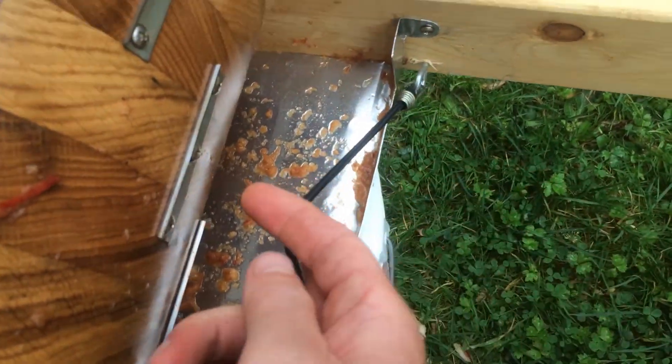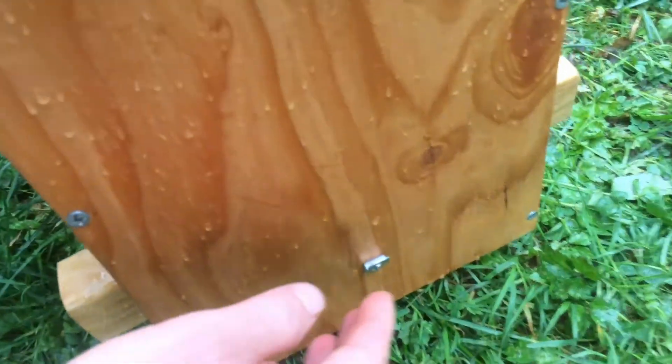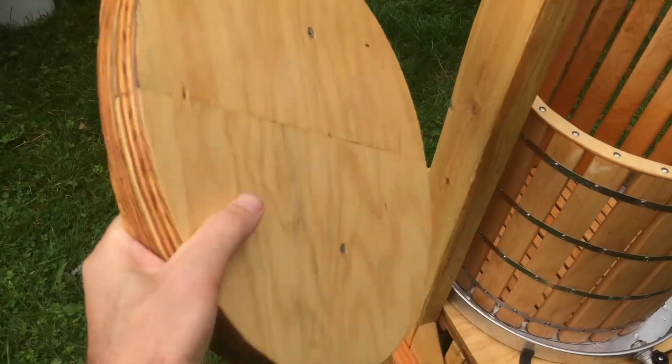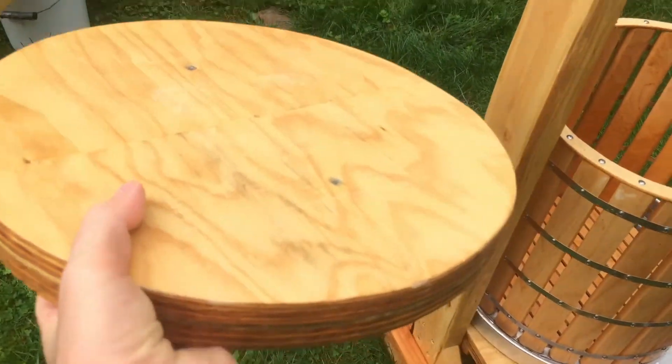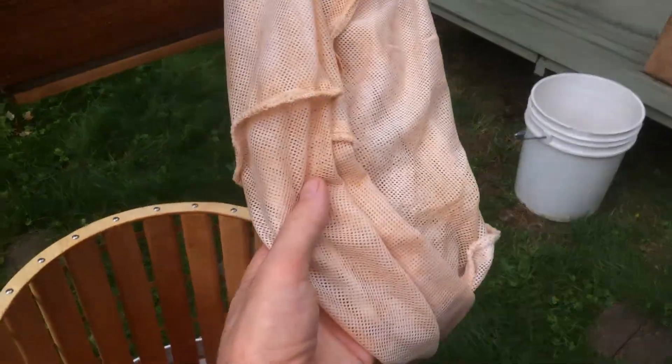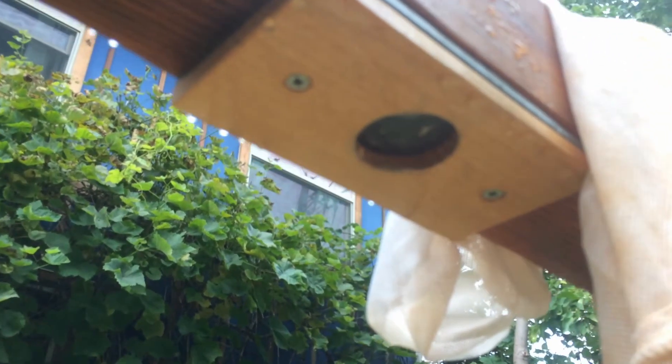Here's that splash guard from underneath. Behind the splash guard is this elastic cord — it just attaches to the back of the housing to help hold it down in case an apple tries to kick it up, though it's not really clear that it's necessary. The press itself uses a press plate of two three-quarter-inch plywood pieces and an assortment of random non-pressure-treated wood block 4x4 chunks that I had lying around. I'm using polyester bags that I bought online — they're working great, haven't torn or anything yet. At the top of the press there's this metal plate to distribute the force of the jack, and then there's a wood piece to center it and hold it in place.